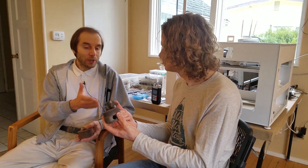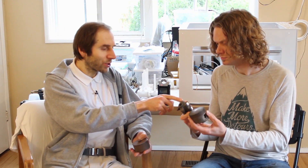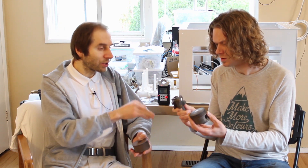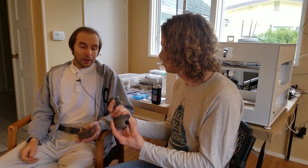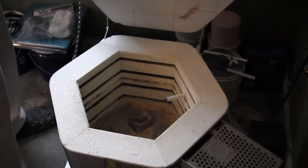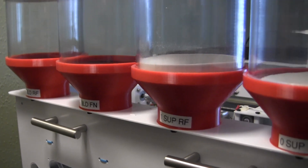Even in an annealed state, it's very hard to post-process. I can grind it, though it took a while to sharpen because it's so hard. You cannot drill it, you cannot machine it. So this is too much carbon. And if we get an affordable high temperature kiln, we'd be able to print lower carbon steel, which I think would be a very widely usable material.